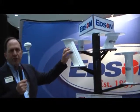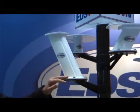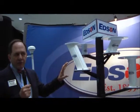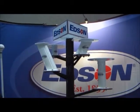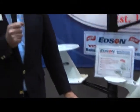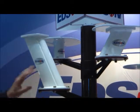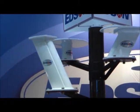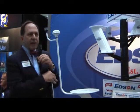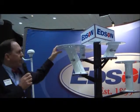What we've done is we've developed an extrusion that allows us to manufacture very efficiently in the United States a tower system that consists of a base and a section that can be either 6 inches or 12 inches or even longer to your dimensions or to stock dimensions. So we can custom manufacture or we can provide stock equipment right off the shelf. The bases are virtually all the same to a certain size range. You determine the elevation and then you pick out the piece of equipment that you want to put on the tower, and at that stage we send you a plate that mounts on the tower that will accept the equipment that you want to mount there.